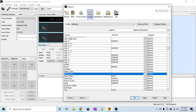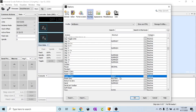It's going to be the same starting point, datum, but your second bit might be longer or might be shorter, so you need to reset that Z0, so you're consistent with your carve. That is why I have that one. That's why I do select the Z on its own.